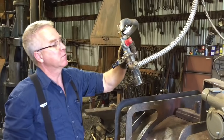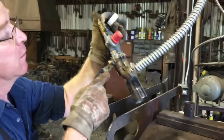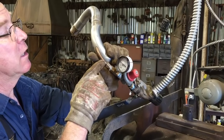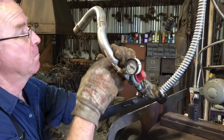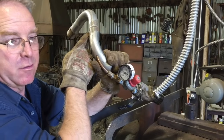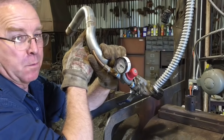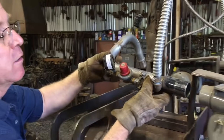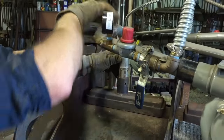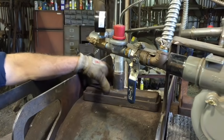This is the mixing assembly. It transfers the propane from overhead through a gate valve, by a regulator, pressure gauge, into a quarter inch copper tube. The orifice in the end of this is a 60-thousandths diameter MIG gun tip — works perfect, threads into the copper tubing, slips into the fan, rotates, and slips into the ribbon burner.